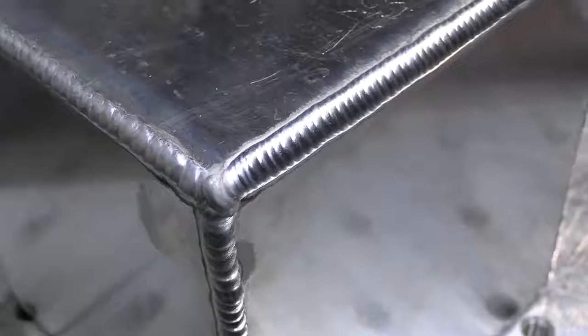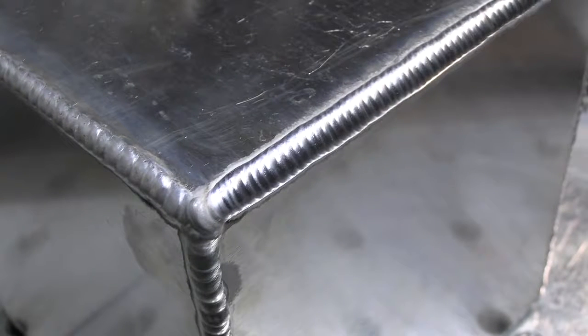So here I'm just walking over the rod, trying to move along at a fairly steady clip, sliding along with that TIG finger. You can see me looking through the cup. Huge benefit on certain areas, like when you're welding down in a corner where you can actually see through the cup and feed wire and see what you're doing. Not necessary completely on an outside corner like this. Again, it just helps me with filming so that we all can see everything.